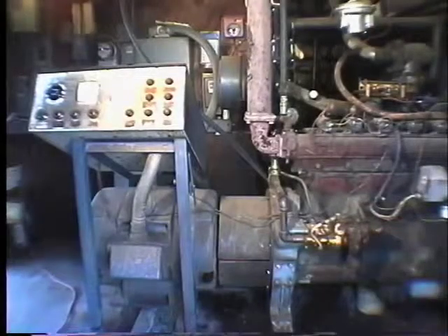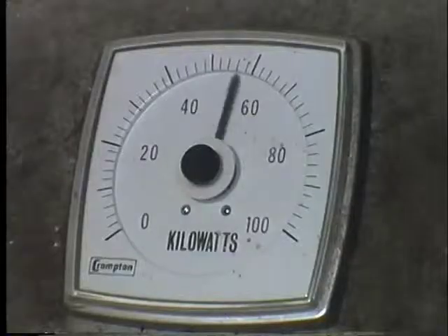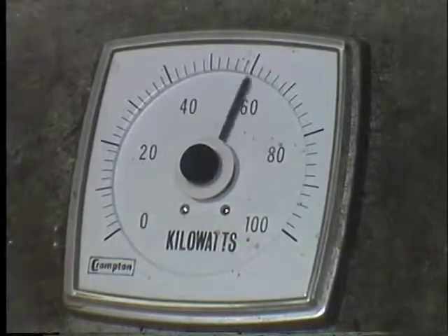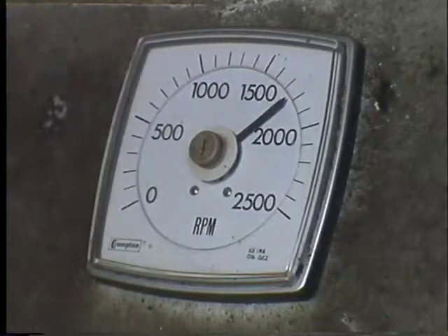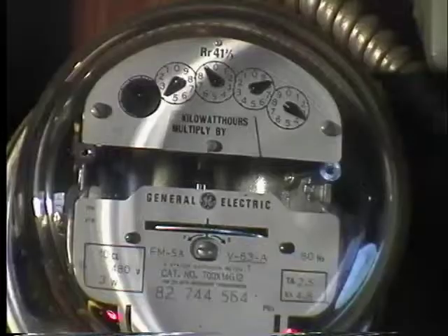I've got two motors so we always have one running. One of the reasons we got two motors is we're producing somewhere around $120 worth of power a day, and once you start doing that, you really don't want to have a lot of downtime. We want to make sure we have time to overhaul an engine properly, and yet keep the digester warm and running. The generator is the original — the last time we shut down it had 15 years on it. We took it in to a motor shop, had it checked over, they put new bearings in it, but the condition was very good, and it's back in right again.